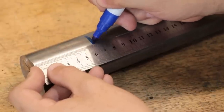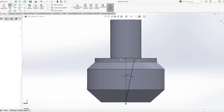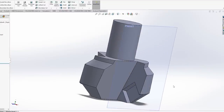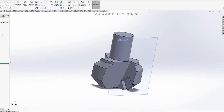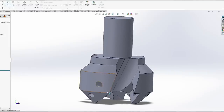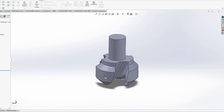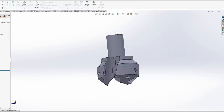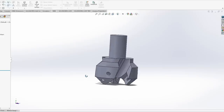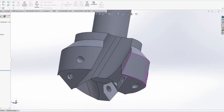While I get the piece of steel cut off, we can jump into Solidworks and get a rough idea of what we're going to make. Originally the plan was to come in with a big end mill and take a big cut out of the side to create the flute, but it looked a bit crude and there just wasn't much material between each of the cutting inserts, which might have caused some issues. After a few changes I ended up with a more conventional style that can hopefully be made on manual machinery — at least hopefully. Just because it looks like it can be made doesn't mean it actually can. And I'm looking at you, every one of my friends who became an engineer or designer — please make stuff that can actually be made. The design will have the inserts tilted back at a bit of an angle to make the cutting edge effectively sharper and the cut a little bit easier.